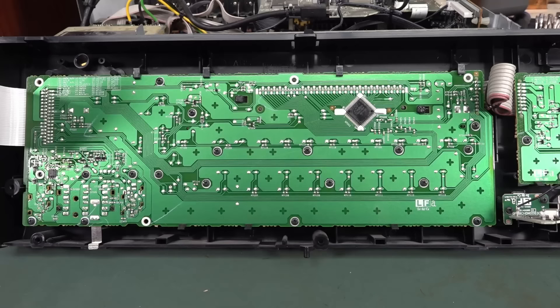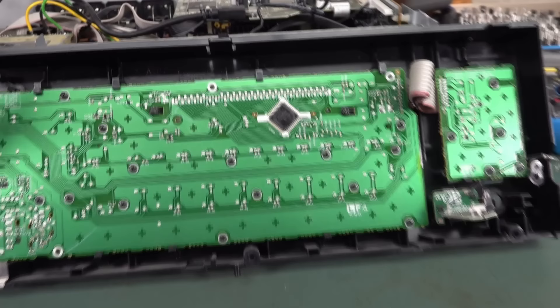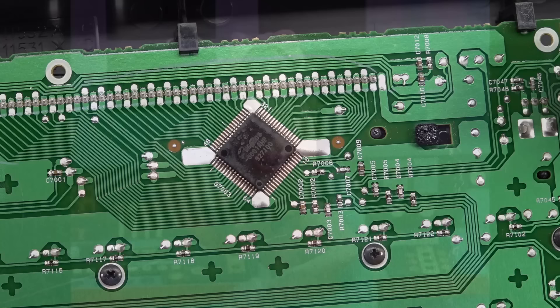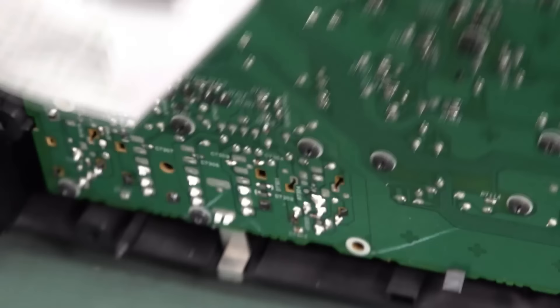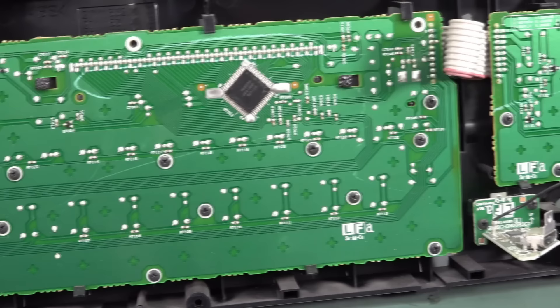Well, there's really not a lot going on here, is there? That looks like a single-sided jobby. We've got one quad flat pack there. This is all wave soldered, by the way — the solder feed in there when the big solder wave comes over it. That's to ensure that you don't get any Klingons and stuff like that on your joints. Well, nothing worse than a bunch of Klingons. It's probably a custom jobby — it wouldn't surprise me at all. And there's a little bit of action happening down here — some discrete transistors and a little 8-pin SO there. But that's just like the audio inputs. They were actually working — that was working fine. So that's probably like a JRC audio amp or something like that. So really there's no power supply stuff on this at all. I'll get the board out and flip it over.